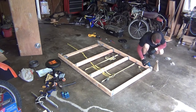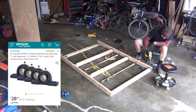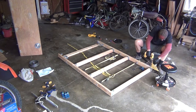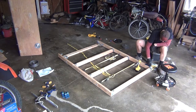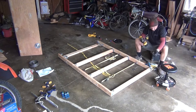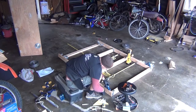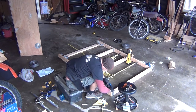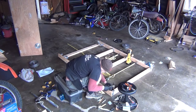Right here I'm measuring where to put my bushings. I picked them up at Amazon for $28 — four of them, they're an inch in diameter. I was making sure my drill is straight up and down, using my center punch to make sure my drill goes straight.